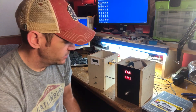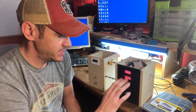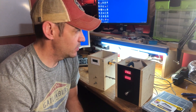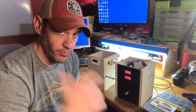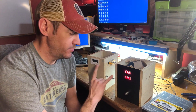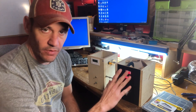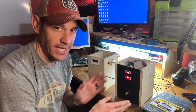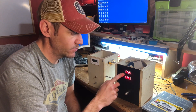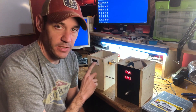The other difference between these two is the counters. This counter can only count up to a certain speed, while the new one can count as fast as you want. If you didn't see the video where I put this counter on a 5,000 RPM motor and it kept up, I'll link that too. If you want the quietness of this pickup winder but don't want to do all the Arduino stuff, you could use this simpler counter — you just have to size the pulley so the winder stays within the counter's speed limit.